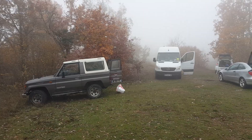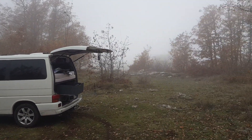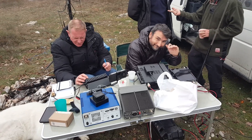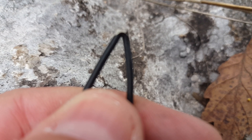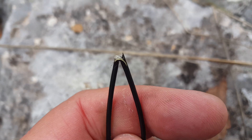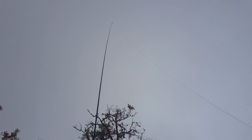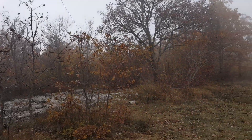I have no doubt about the performance and we're going to set it up and test it out. It's getting a little foggy here — usually we see pretty far but now there's cloud coming down. The guys are busy operating — Eric on the left, Jeremy on the right. I did notice a little kink in the wire and the insulation actually broke — the wire isn't broken but the insulation is. I installed my Spider Beam 12-meter mast with the antenna, so it's going to be a sloper — half-wave on 40 meters, around 65 feet long, going down to my operating position.